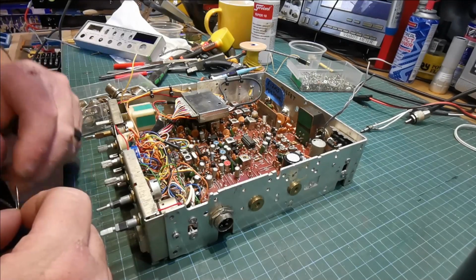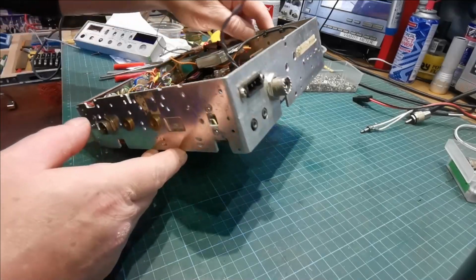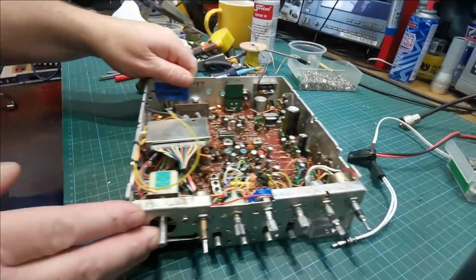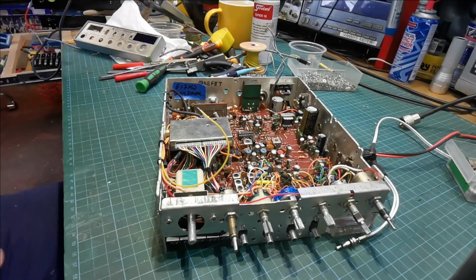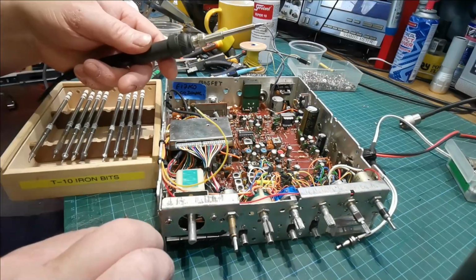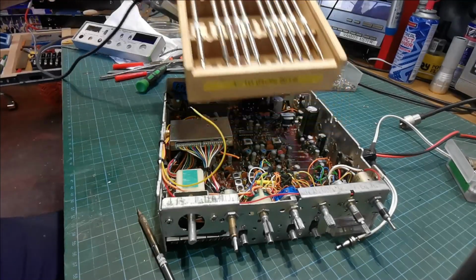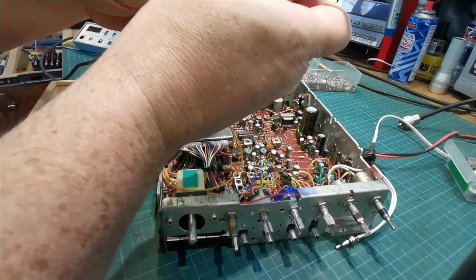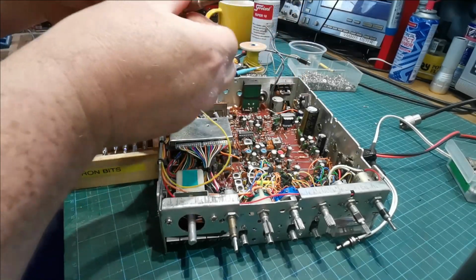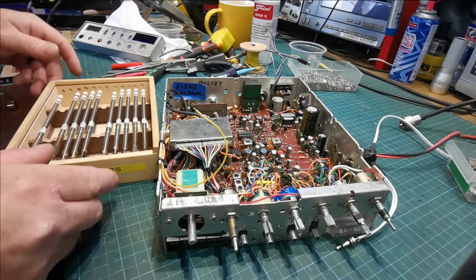So we're going to end up pulling the socket out temporarily, and yeah, so we'll turn on the iron there. Oh wait, no, I need to change the tip that's in it. Where did I put them? I'm after putting them somewhere different now. Just take that off, pull it out, put it into my box. I have a selection of elements for it. And we'll put in this. For this type of work, you want a bit that has a good flat area on the end of it. The needle ones give very localized heat, so not much good in this application.